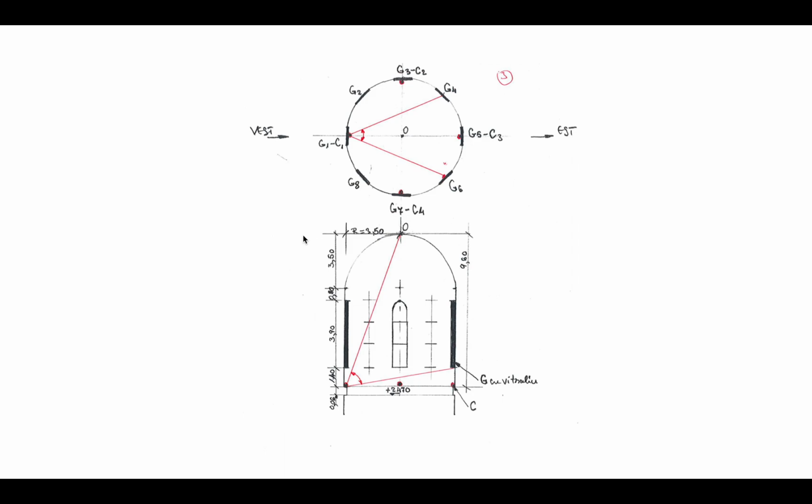Moving on to a different view. This is an upper view of the dome, and this is from a longitudinal view. I tried to orientate to split the light, because here it would be almost around 70 degrees. So it should be a projector with a very wide beam, which is quite difficult to find in such a small form factor of the product. So then I split the light in half by using, as you have seen in the pictures, 2 luminaires instead of 1 for each position.